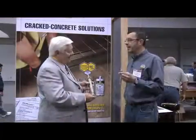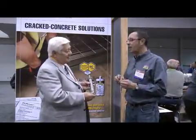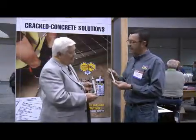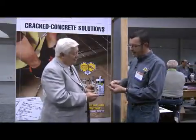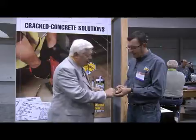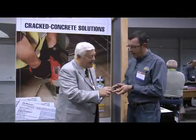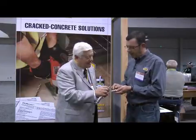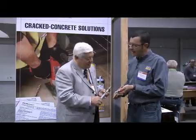What you're holding is a little more for the everyday cracked concrete contractor — it's more economical, but it too has a tri-segmented clip, almost like a flange. This is the mandrel and it slides over the mandrel and expands in the hole. The tri-segmented clip allows it to handle whatever angle a crack will pass through.